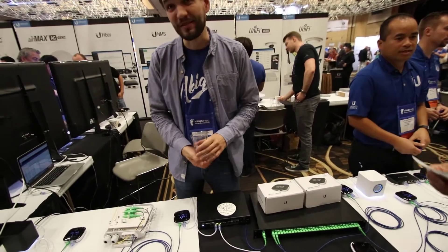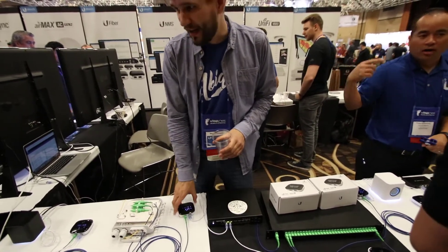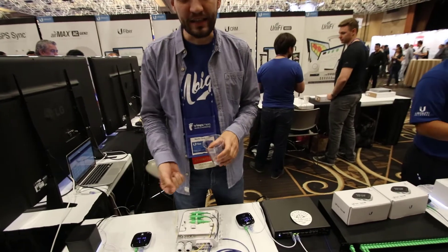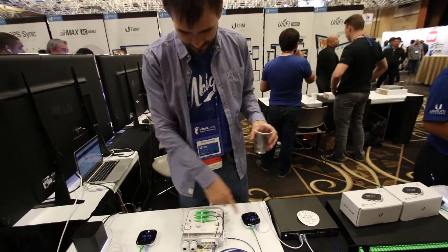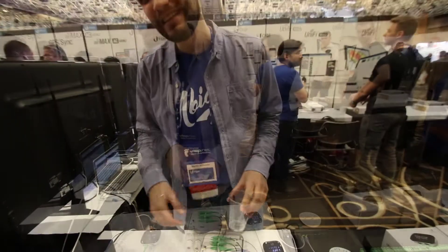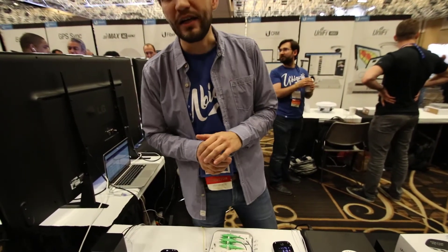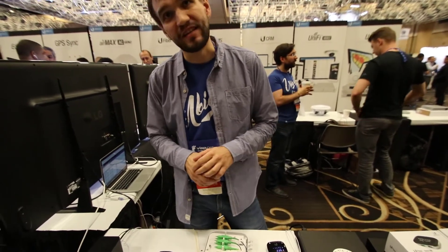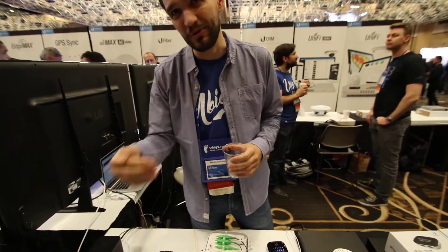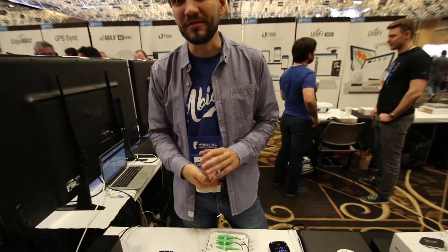This is the first device for the cheap one from Ubiquiti — this is a CPE called NanoG. You can see the OLT over here. The OLT is 8 ports and it can handle 128 clients on each of the ports. It's not recommended to go up to 128 because the splitting would be too much and you would get much shorter reach. But around 100 is perfectly okay and it's tested.